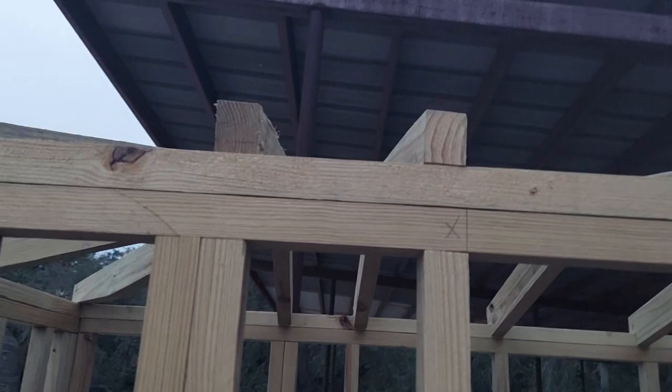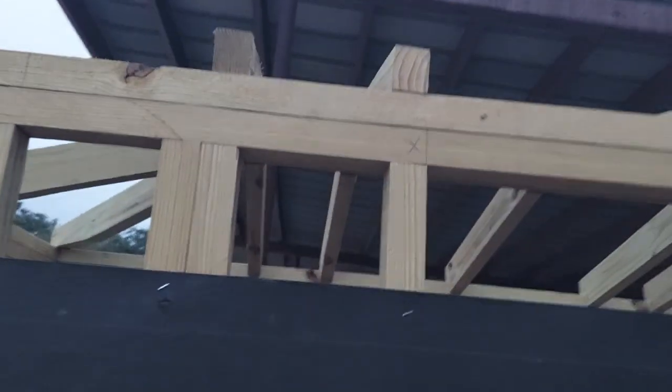So next I've got some scrap pieces of tar paper that I've cut off the edges. And these pieces right here, they're going to be good enough. I can hang them. It's all flimsy, it's hard to say, but there's your rafter again. And if we get that up there with the rafter, well, then it covers the top of the last piece.